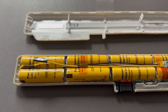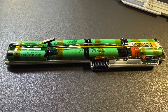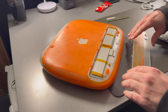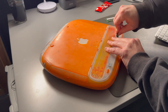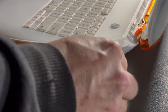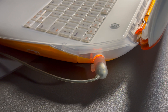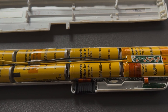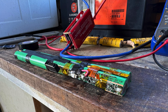But to my surprise, someone was selling an untested battery for £20, so I bought it. The layout and internals were vastly different, but much easier to connect up, so I got out my soldering iron again and gave it a try. Unfortunately I couldn't get the case to go back together no matter how hard I smushed, so gaffer tape to the rescue to fasten both sides of the case together. It's fine, just don't look at it too hard. Initial results looked promising — the charging light went green, there were no bangs, pops, or appearance of the magic smoke. Then after Mac OS had booted, the light turned amber and it showed as charging. But is it fixed? No. I made a schoolboy error — the cells in the new battery I bought were backwards compared to the originals, and I'd not noticed. So I'd spent all that time spot welding and soldering my replacements all wrong.